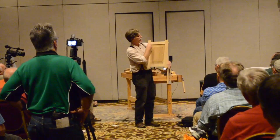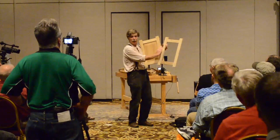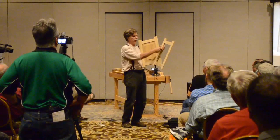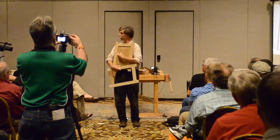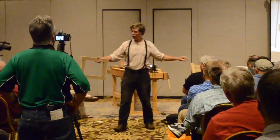So what we do is define the dimension of the door with long grain, because wood does not get longer and shorter - it just gets fatter and skinnier, just like us. So we put a groove around the inside, put a panel in there deep in the panel so the panel can shrink and swell without causing any harm. That groove is key - it's essentially the essence of woodwork. So you've got to have a plow plane.